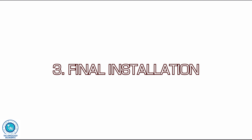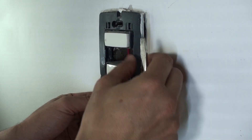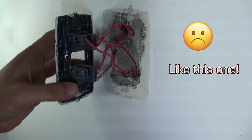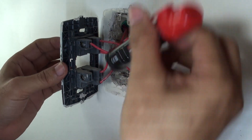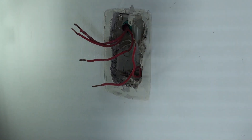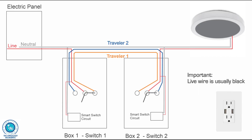For final installation, whether you tested on the desktop first or go directly from the video, before you continue make sure electricity has been cut off to where you're working. Open your electric box and check twice. If wiring is not properly color-coded, do not disconnect anything — identify and label the wires first. You may even need to temporarily reconnect electricity with the open box to identify cables. If the neutral wire is not present, you can run it through existing conduit using a wire fish tape or wire puller, or route it from a nearby outlet outside the walls.